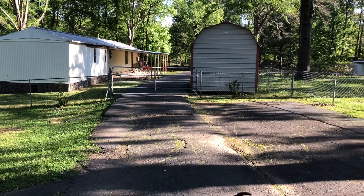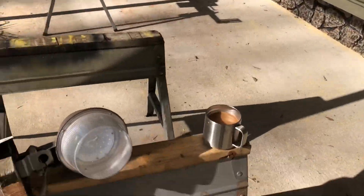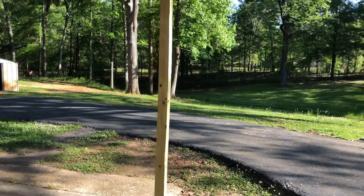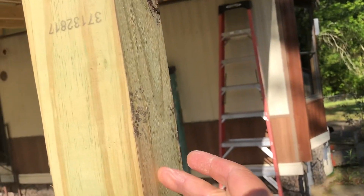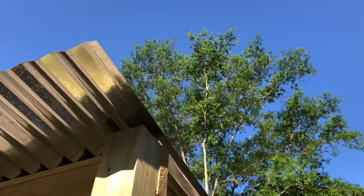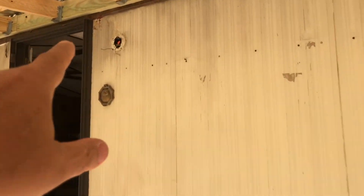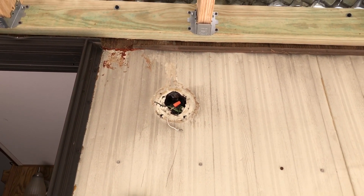Let me tell you what I'm going to do. I have a security light that used to be on the old awning — it was right here on that corner pole, stuck up about three feet. I'm going to put it back up by attaching a metal pole like a top rail for a chain link fence, going up that way. I'll cut a little semicircle out and put it way up there, because the higher you get it, the more light it casts. Then come down with a wire and tie it into that wire there. When the awning came down it pulled the outside light off, so yeah, that's what I'm going to do.